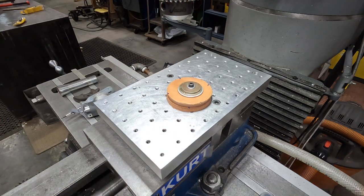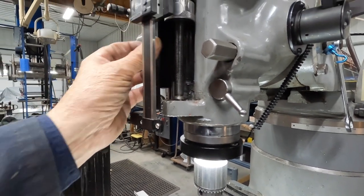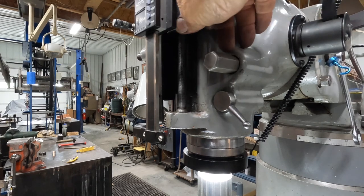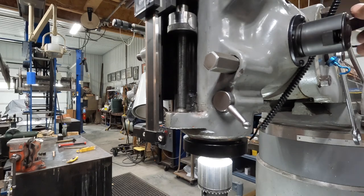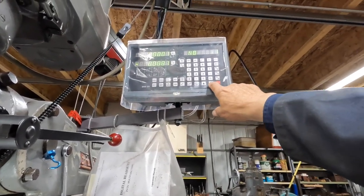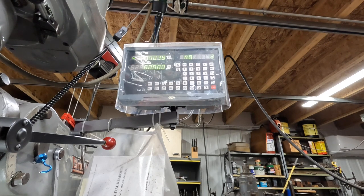Okay. And I need a quarter inch bit. Okay, so I don't drill through my table, I'm going to set my stop here. Okay, so the quill, go up just to, and just right about there. Okay, it'll go through the first layer completely and almost through the second layer. So, okay, that was it. Now we just have to remember. Number 2, so then we gotta go 0 this one, there we go, and 0 this one.